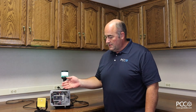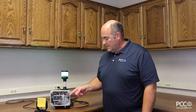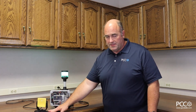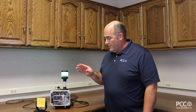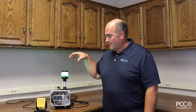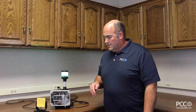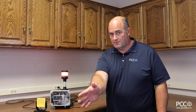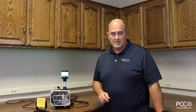The device is connected up using an M12 connection and can be daisy chained through the sensor. It has a nice pivot device for positioning the sensor the way that you want. With this particular demo, we have a stack light that's indicating whether or not you've entered the safe zone. If I slowly move in over here, you can see it detected me. And as I move back out, the device goes back to standard mode and the system is safe again.